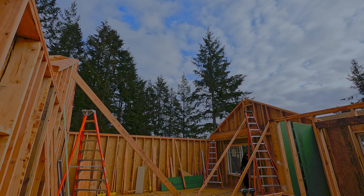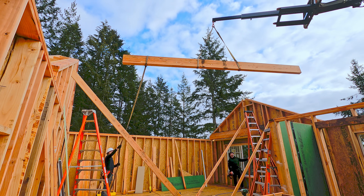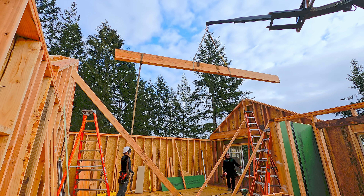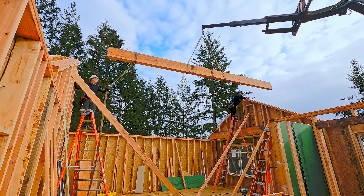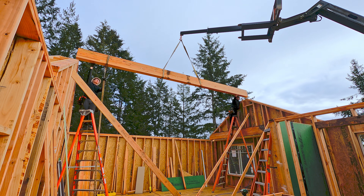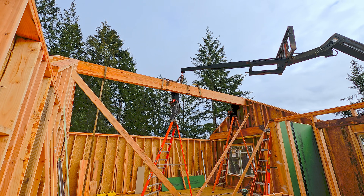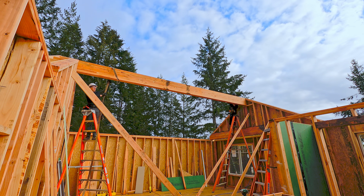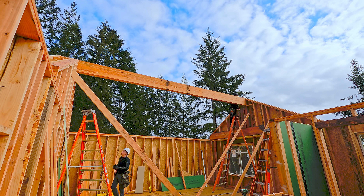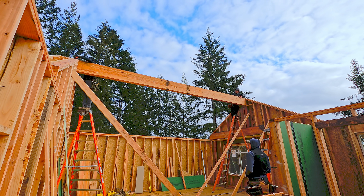We're up to the roof framing in this video. Behind the camera — which you'll see in some drone footage — we had the gable front to back, so we set that ridge just to lock all that in. Seems like every time we lift rake walls we get high winds. In this case we're setting the ridge beam that's over the master bedroom and the master bath. We elected not to frame any interior walls — you can see there's lots of room for the ladders — plus with ZIP roof we'll be dried in and then we could frame that at our leisure when there was bad weather.